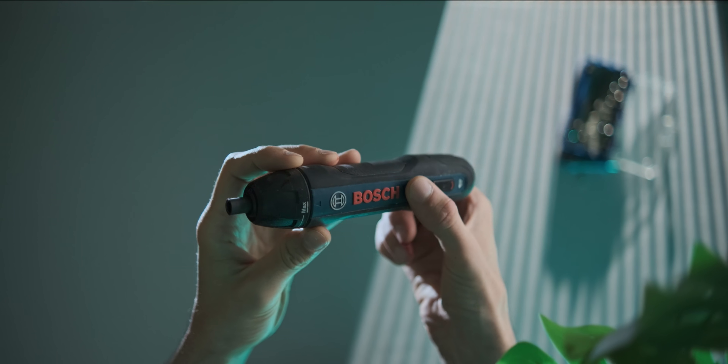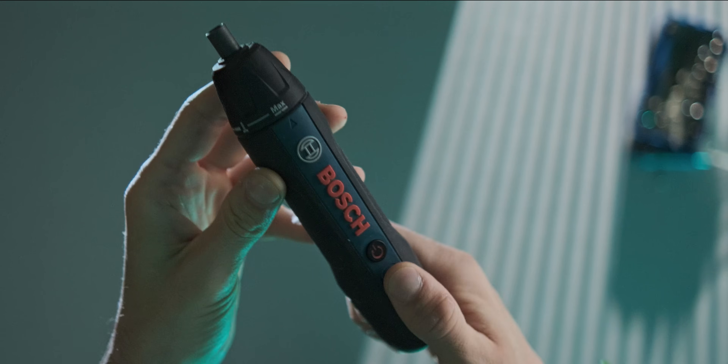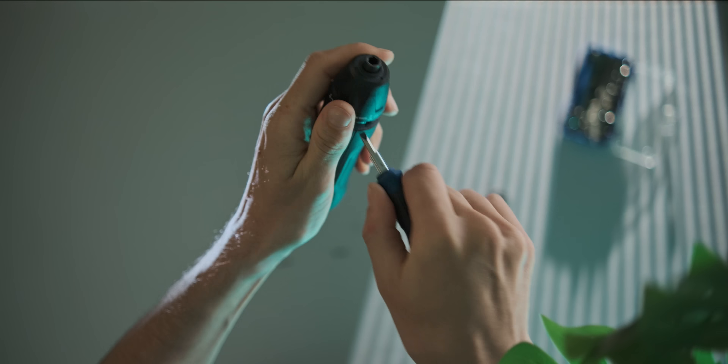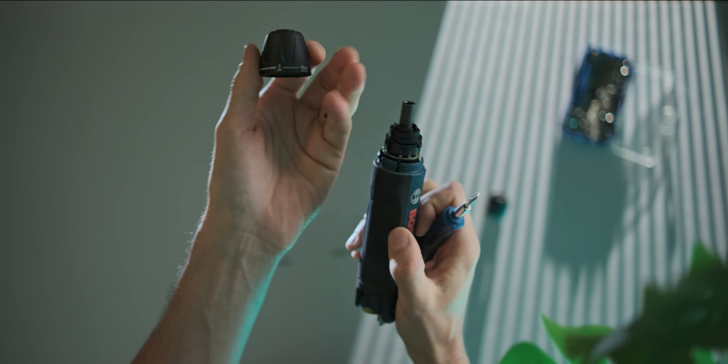So I can figure out like, okay, will it fit in the desk setup? The second thing I really wanted to integrate is some form of drill, because often when I'm 3D printing stuff and adding bolts to that 3D print, I make them just small enough to where it threads into the 3D printed component. You really need the drill to push it through as it heats up and melts a thread into that 3D printed component.